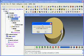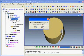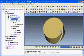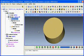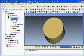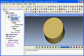In the normal way, Vericut prompts us if we want to resave the tool library. In this case, I'm going to say no. So that's how it worked in the old 6.1. In 6.2, what we can do is check against the tool length being too long. Therefore, we can shorten the tool length and increase rigidity within the tool itself.